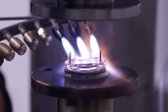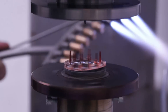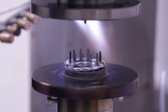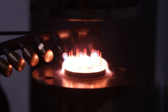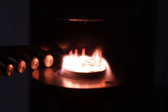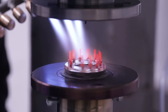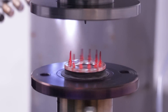The good point is that the ejection mechanism works, but the glass still tends to flow over the edge of the mold. The problem is that we used two tall glass rings, so there was a lot of glass and it formed a torus extending beyond the edge of the glass mold. The shape of the glass beads looks great. The question is how to get the glass flowing to the center of the stem.